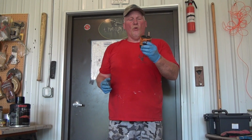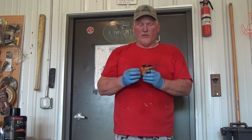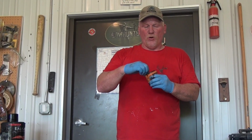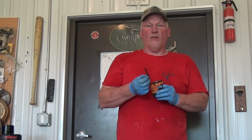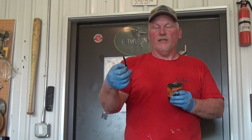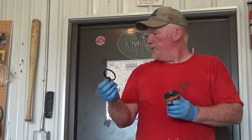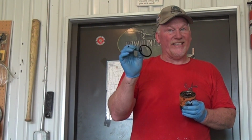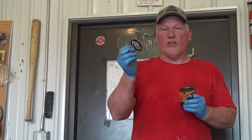Okay, just a couple tips and watch-outs. When you're removing the old filter, I've got some pretty good video of it here, when the filter's removed, clean that, and then make sure that there's no gasket material or parts of a gasket left there. When I removed this one, for example, this gasket was stuck up against the tractor, and if I didn't know to look for that, I would have put the new filter on, and most likely it would not have sealed, and there would have been at a minimum an oil leak there. So make sure that this seal from the old oil filter is removed.